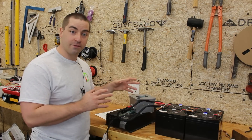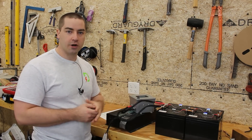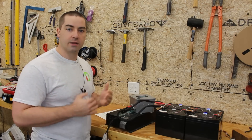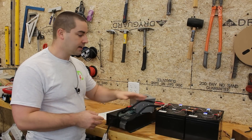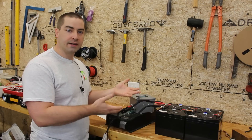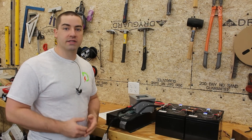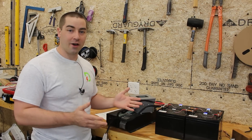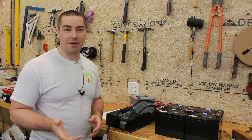Now when I go to charge the full pack in series using a 48 volt charger I can bring them all back up together. I might set the maximum charge voltage at 56 volts and my minimum cutoff at something like 49 volts — that keeps you inside the bulk of the power without going to the absolute top or bottom of the voltage curve, making the batteries last longer. If they were out of spec and you constantly have a BMS shutting down because one is constantly hitting high or low voltage, that puts extra wear and tear on batteries you just don't need. Having them balanced avoids that. Six percent extra capacity and added longevity — I hope that makes sense and answers the question about how to commission the system. Please like, subscribe, comment and share. Thanks everybody!